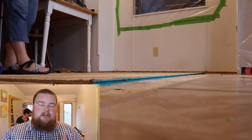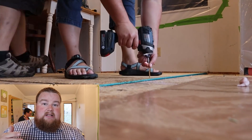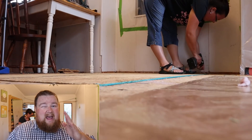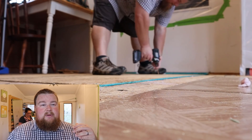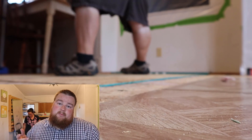One other thing about the floor — if you notice, we staggered the joints, or the ends, of each plywood OSB board. You're supposed to do that, and you're supposed to do it by half a sheet, but we didn't really want to waste the only sheet we had here at the house, so we did it a couple of feet off from the ends. Not perfect, but still better than not staggering at all. That's it for that piece — another day, another sheet of OSB down.